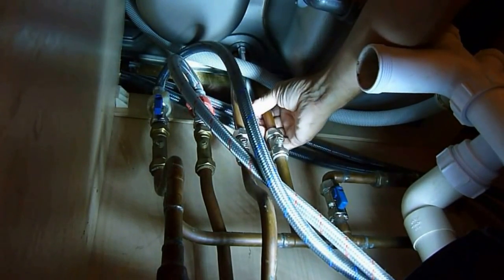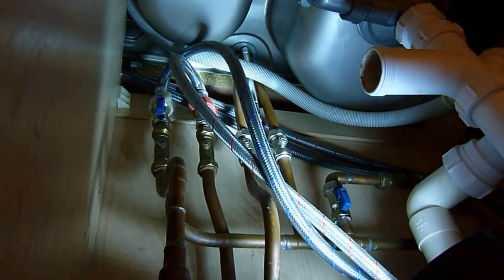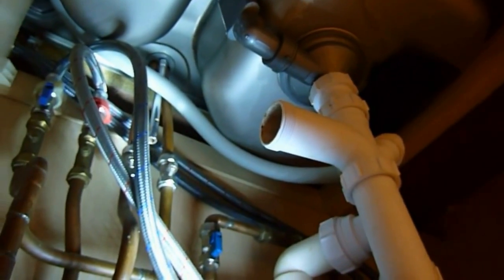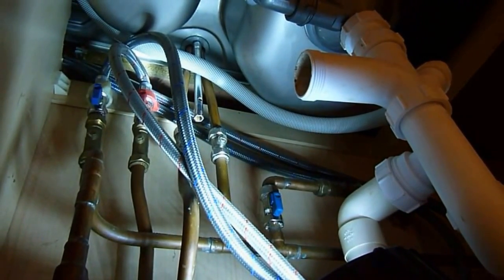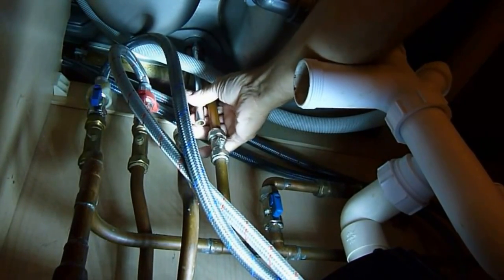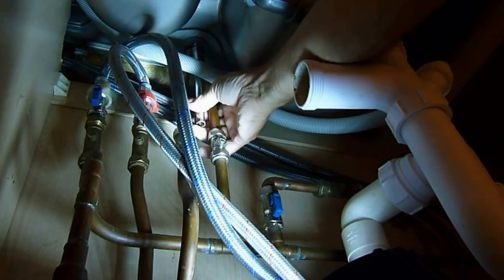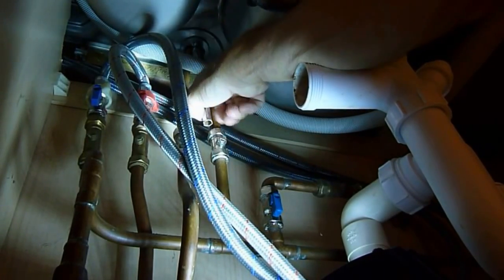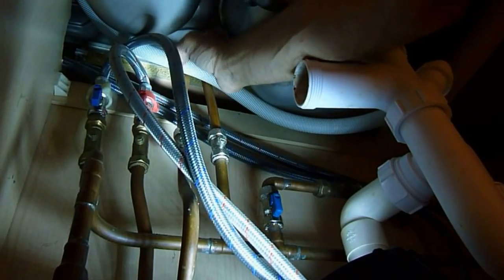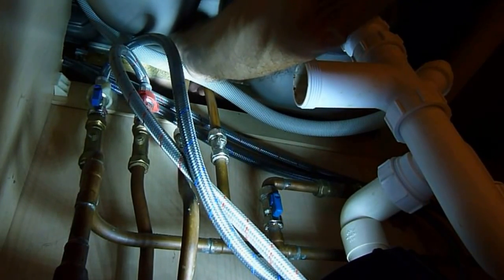It's not too tight. It's a fairly modern tap so it should come off fairly easily. As I turn it now you can see it start to come loose. I'll lift it up and you can see the nut coming away. Shine it back up - undo that and take it out. This horseshoe arrangement is the awkward part of the job - I actually hate it, it's a terrible arrangement. But the new taps going in have a nut and bolt which I prefer. As you can see it's coming undone and we can probably do it with our fingers now.